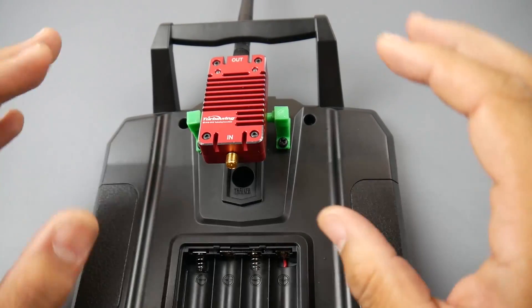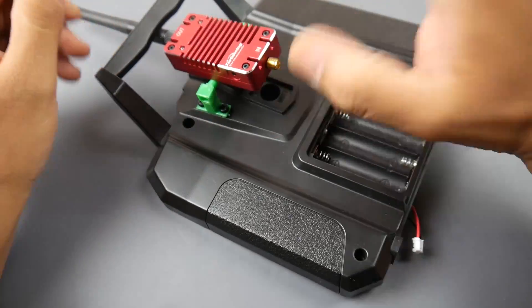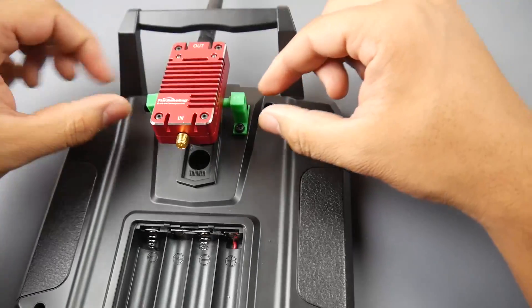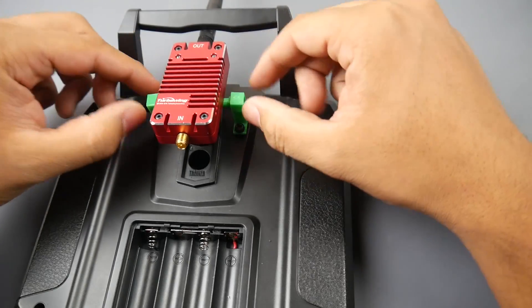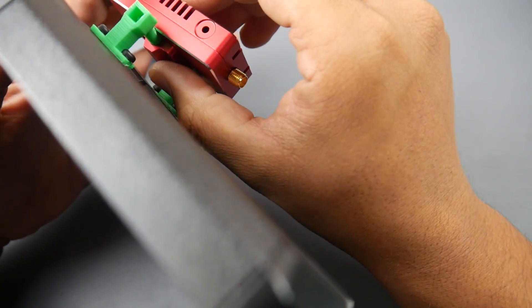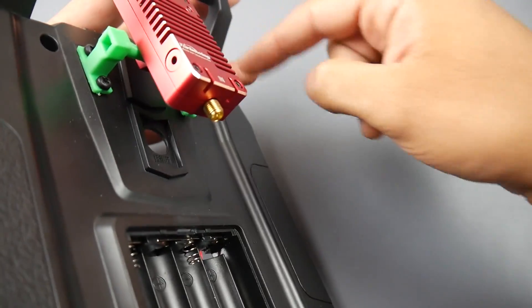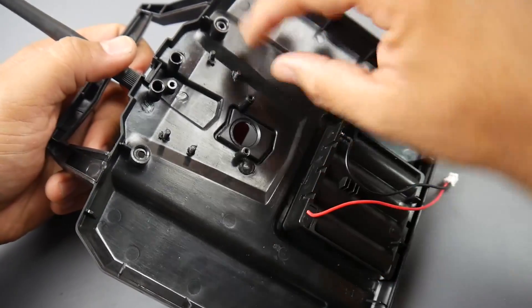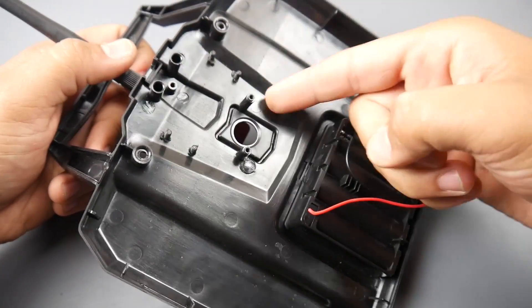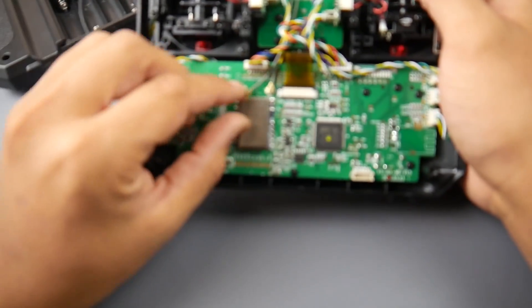The 3D printed design is complete and it fits pretty well. It's in three pieces — two adapters plus one piece that holds them in place. I made two holes on each side with a screwdriver and inserted nylon standoffs, which is great because I can cut them down if needed since they're plastic. It's holding really well.